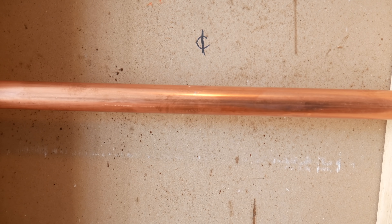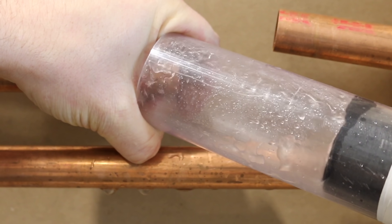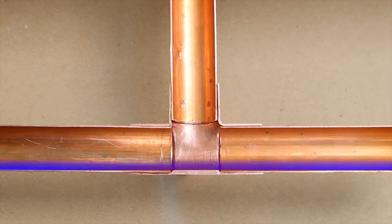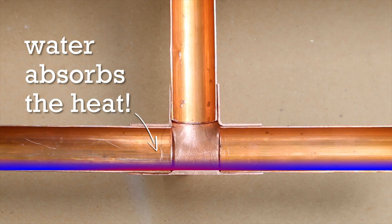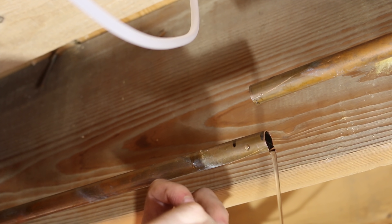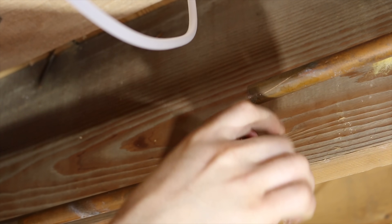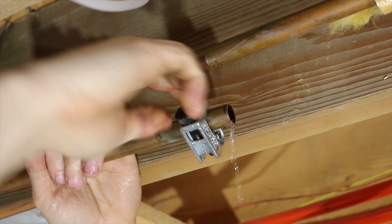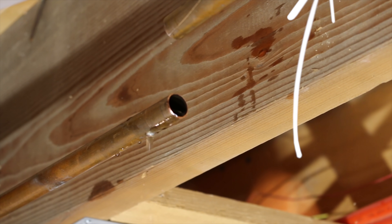Number 6 is making sure there's no residual water in the pipe. I made a whole video on this — it's basically impossible to solder with water present. The reason is that the water absorbs the heat while you're soldering and doesn't allow the joint to get hot enough. This happens mostly when soldering in a basement, as water from upstairs dribbles down into the pipes. I'll put a link in the description if you want to know how to solve this problem.